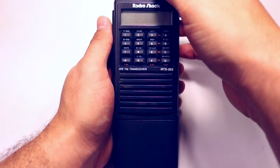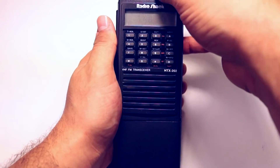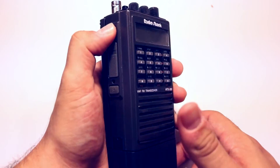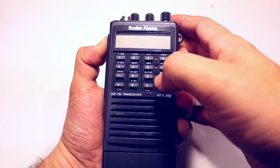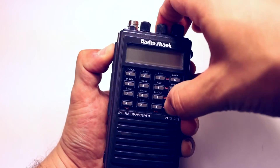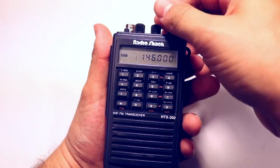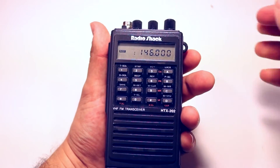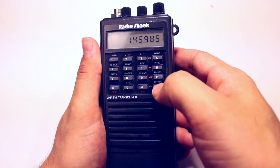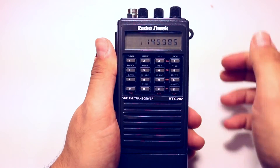It's all back together. We've got the battery back on here. We'll go ahead and turn it on — and you'll see that the ER1 error is still flashing. So we actually need to reset the processor. To do that, you're going to press the function key — the F key — and D while it powers on. So I'll turn it off, turn it on. There we go — and you notice it doesn't complain. So we fixed it.